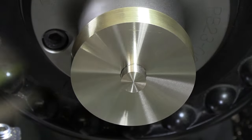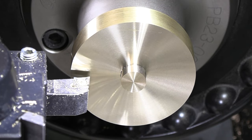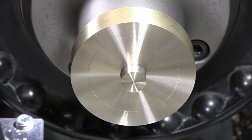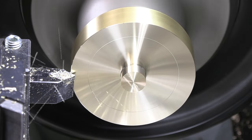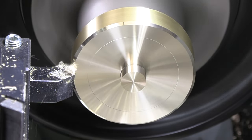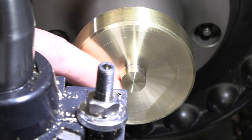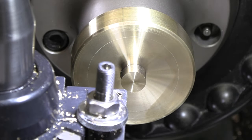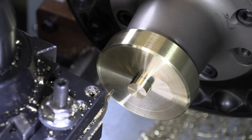Okay, 750. We are right where we want to be there. Let me get my mark on here at 2.1 inches. All right, let me get my 50 thou bevel out here while I'm thinking about it. All right, I'll see if I can get a little better camera angle in here this time as we machine out our groove and our taper in there. Get that done, and we're just ready to drill some holes in here. Tap our cross holes. Heck, man, we're just about ready to run this thing. Stay tuned. All right, I think that should give us some pretty decent camera angle in there.